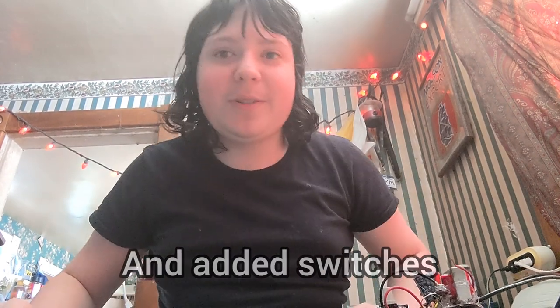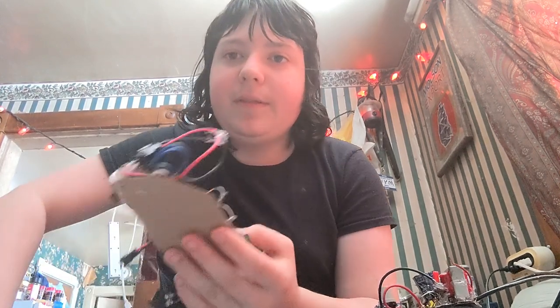That first power supply I didn't really make — I just took it out of something else and jammed it onto a piece of cardboard. It already had its own rectifier board and was full wave rectified. But all my completely homemade ones — made piece by piece, solder, glue — like the 8 volt one, those are half wave. That one's half wave, this one's half wave.